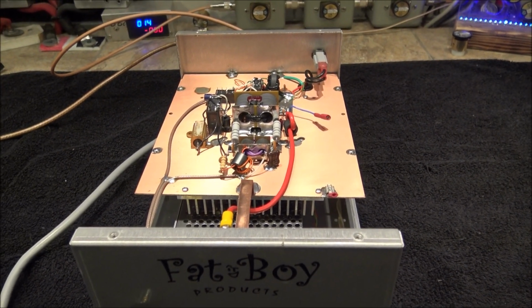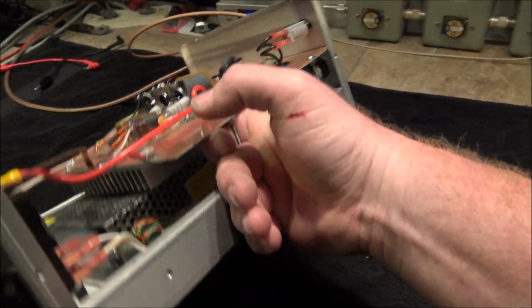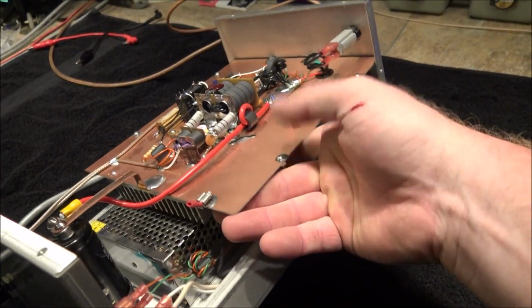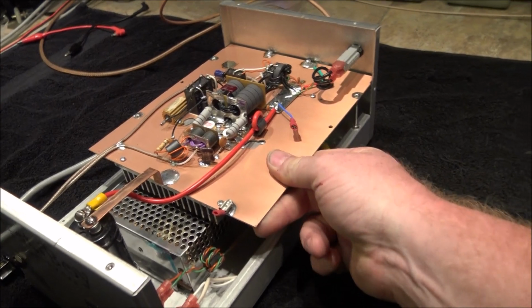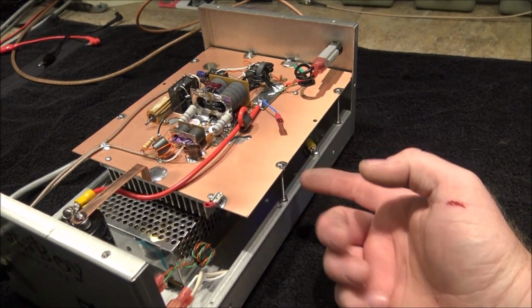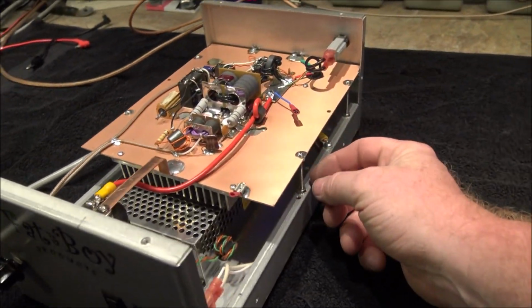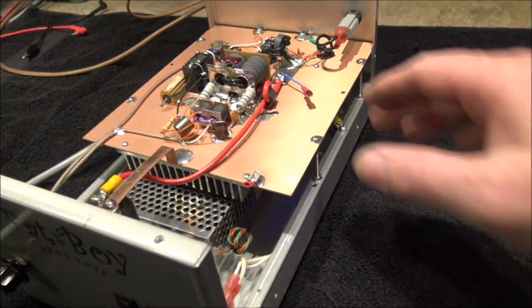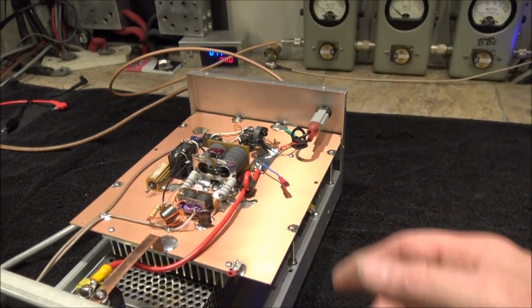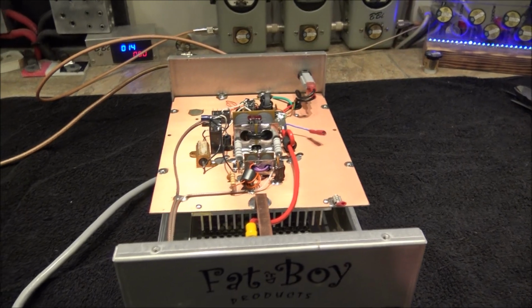So, like I said, bro, in the last little hunk of the video, I was going to take this amplifier apart so that this board would be fixed and not be loose, which meant I had to undo all the nuts. I actually had to add 4 nuts on the bottom of each one of these posts, but to do that I had to back everything out. It was a process. Unsolder this and then take out the fuse holder. So here we are, we're all done.